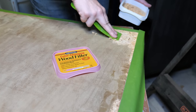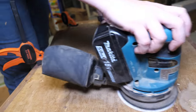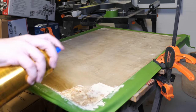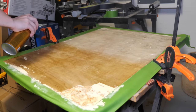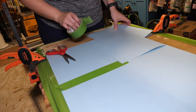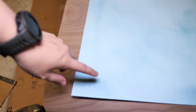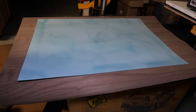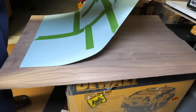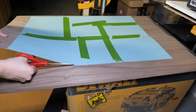Wood filler was applied to the surface to help level it out and get everything smooth. After I sanded the surface down I ended up sealing where the veneer was removed with polyurethane. I'm going to need to cut a replacement piece of veneer, which I have a scrap piece on hand from another project. To get the right size I used some cardstock, placed it where the veneer would fit, and taped the pieces together to form a larger template. I'm sure this could be done with a large piece of paper and a blade as well.